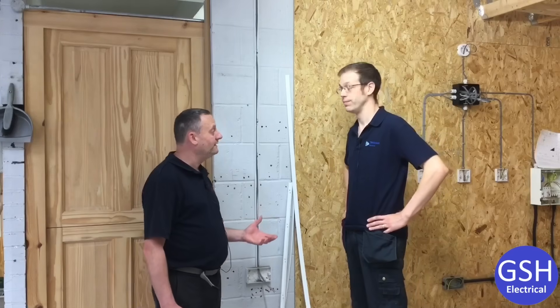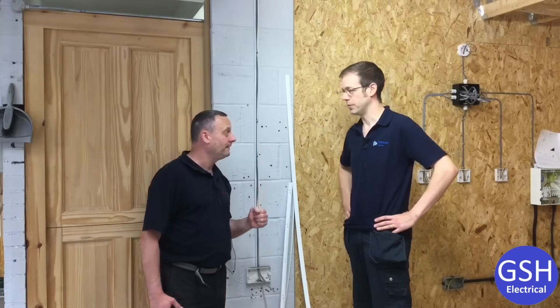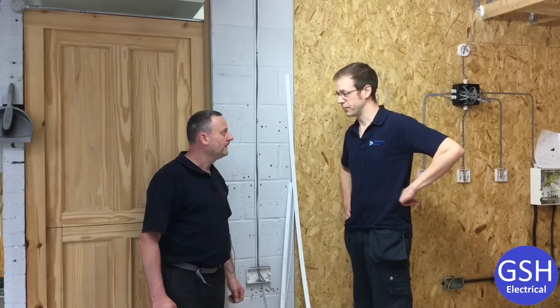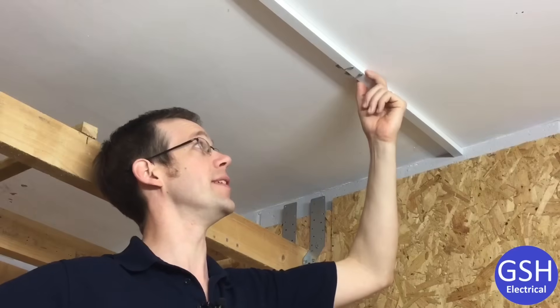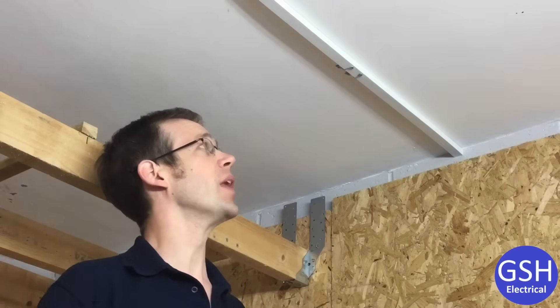This is one regulation I suggest we won't say we won't apply retrospectively. I believe fire officers will go around installations and say there's a lot of surface mini trunking and cables up there that will come down in the event of a fire. Is there a solution for an already fitted system? We do have a retrofit solution. If we look at the ceiling here, we've got a piece of existing Marshall Tufflex trunking screwed onto the ceiling — in a similar situation where, if fire breaks out, it could fall and cause entanglement.